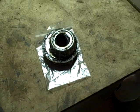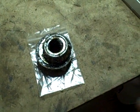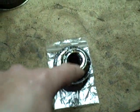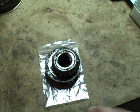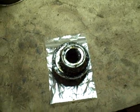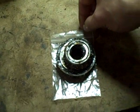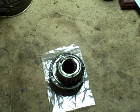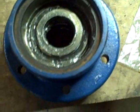Repacking the bearings is exactly as the name implies — you pack the grease in and push it in from all sides. I put on nitrile gloves, dig into my tub of grease, and work and squeeze and push from the outside while rotating the bearing to make sure it gets worked all the way through and any little air pockets get pushed out. Ideally you'd use a bearing packing tool — you put the bearing on, put the top cover on, it has a zerk fitting, and you pump the grease in from the inside out — but I don't have one, so I pack them by hand.